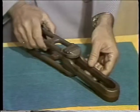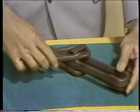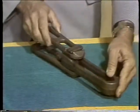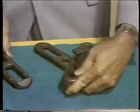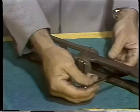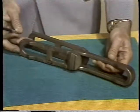Now we have a different type of chain called rivetless chain. This is made up of a single loop here and two sidebars connected together with a pin. By merely flipping this sidebar around, we can take them right out of the configuration, which makes it easy to assemble and disassemble. This particular chain is most frequently used in overhead conveyors. It is also especially good for flight conveyors on applications where the material handled tends to pack in fully enclosed chain joints. This whole unit is normally of drop forged steel and may be heat treated or not depending on the service, and is also available in various alloys for special applications.